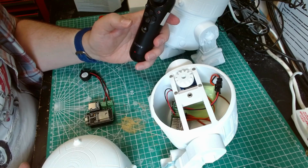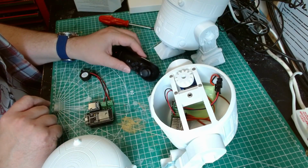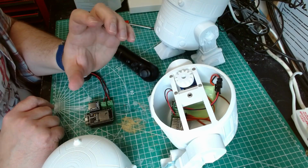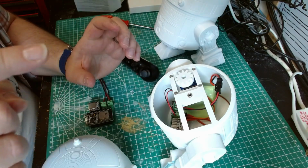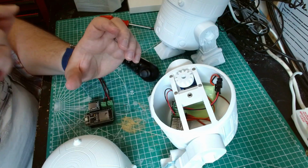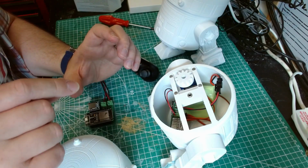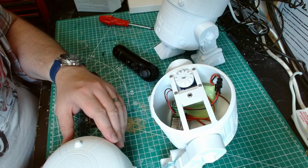It's now reconnected. Obviously, you can have whatever noises you want when you load them onto the SD card. The DF player sees the files in the order that you upload them. So the first file you upload is always going to be file 1, regardless of whether it's labelled 001 or not. I think that still holds true.